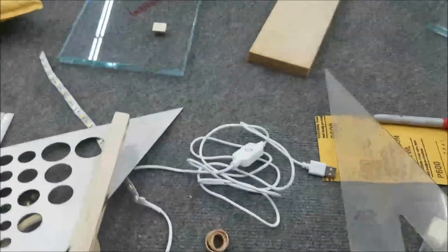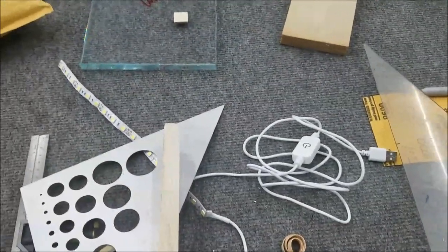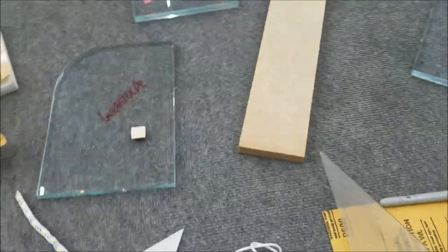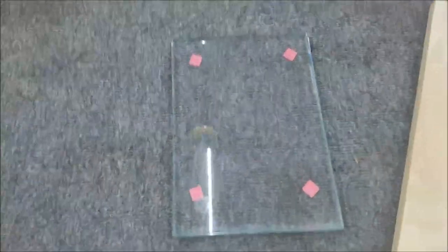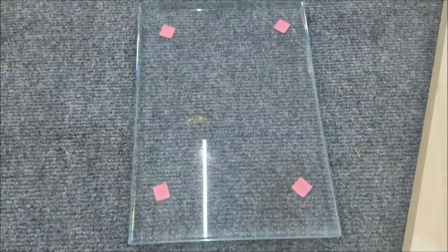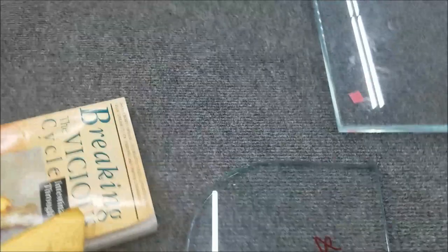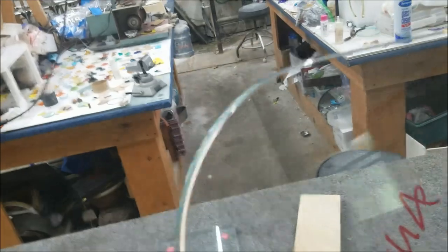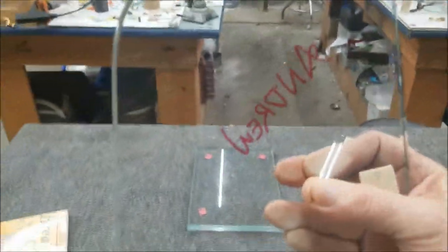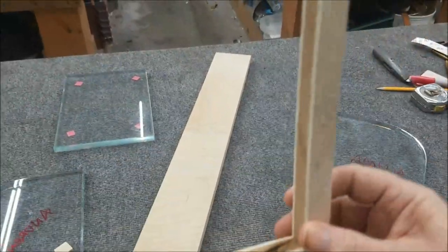All right, like I said, I had begun this job not thinking about shooting a video of it, but then realizing that it's a great little project to start. We started off with these leftover pieces of glass from another project, and these rectangles of Starfire crystal. I needed the corners rounded, so I ground and polished the radius corner to satisfy the design, and I did that for both of these. And then I've started building a frame to hold it.